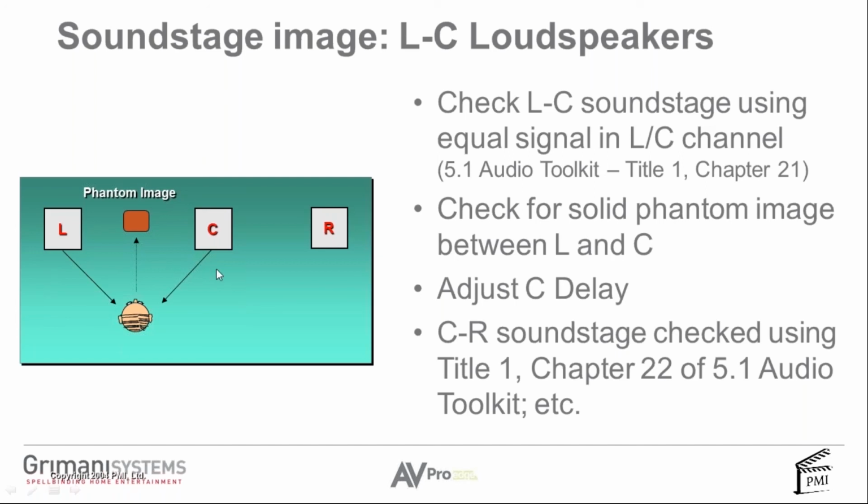If what you had was a regular surround decoder where this was entered in feet, what would you do to delay that speaker a bit? This is like a little, you need a lot of coffee, brain tweezer. There's a formula for it, and I'm drawing a blank right now. But there's a formula. It's one millisecond per foot or something, right? Is it close enough? But in most surround decoders, that data is not put in milliseconds, it's put in feet.